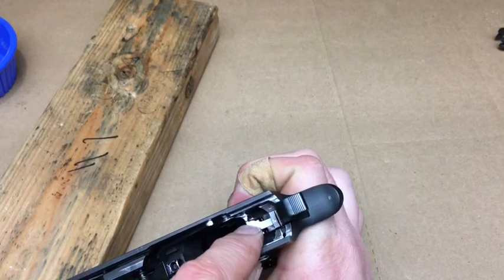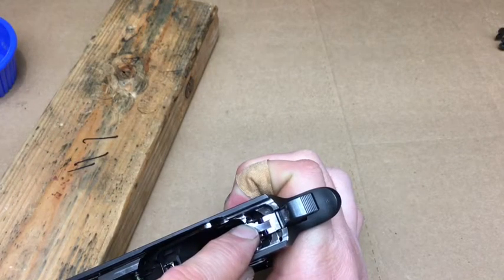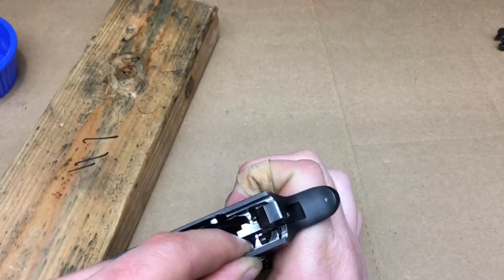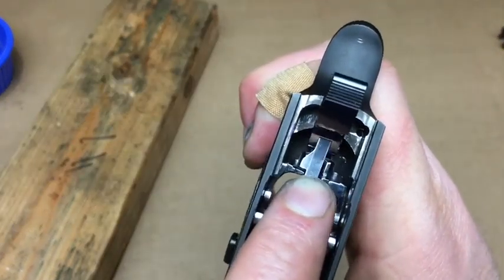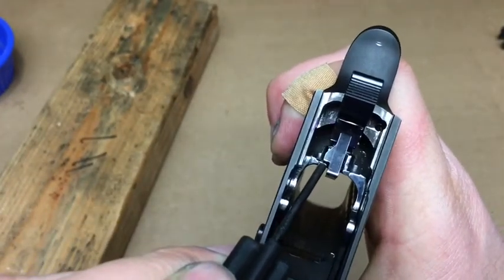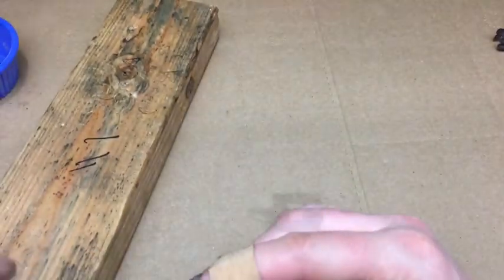Now the wings of the sear cage, the outside corners of the sear cage here and here, contact. They get pushed downward, and when they get pushed downward far enough, like so, the gun fires. So that's what it does in double action. So you can see exactly where, if I do this, that spot right here is crucial to polish. So that's your double action, like the sear, so to speak. And bang. All right. If it'll do that, your gun's put together right.